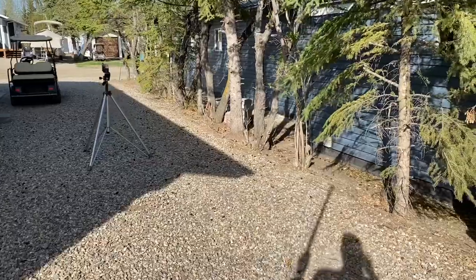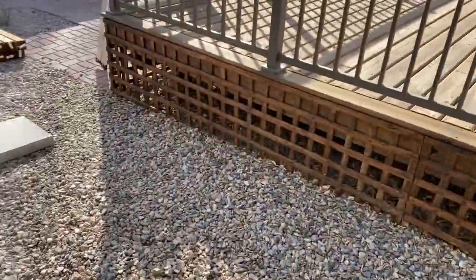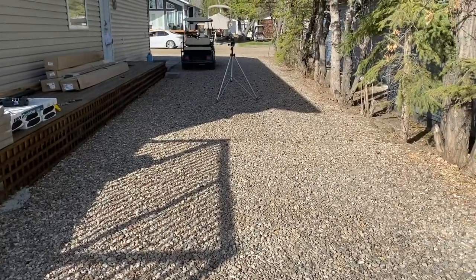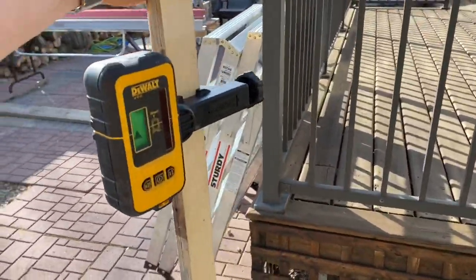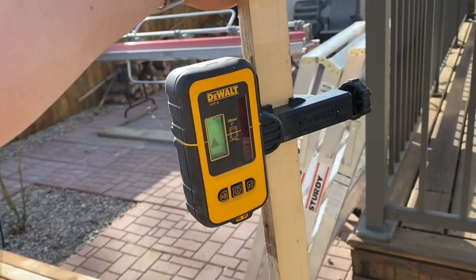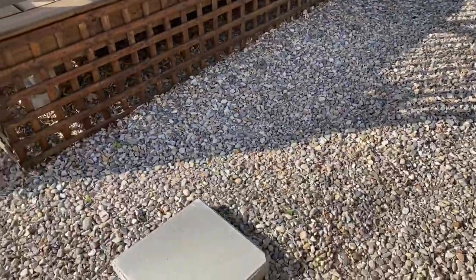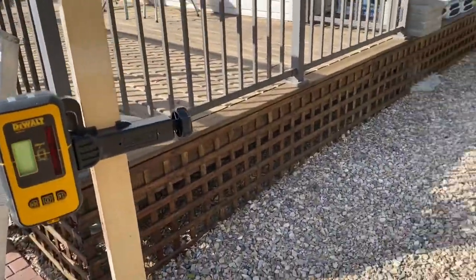The trailer is all unloaded. Basically what I'm doing now is just taking shots with the laser to get an idea of where we're at. I know this area back here is a bit low — it sort of humps up in the middle right there, but there's quite a bit of crushed rock in here so it'll be easy enough to move around. I found that the midpoint is about this corner, so I just have to level that pad a bit. There's going to be nine pads, so having this laser makes it really easy to shoot them all in and get them perfectly level.